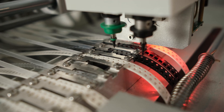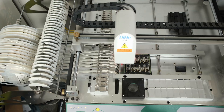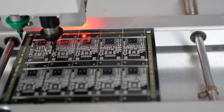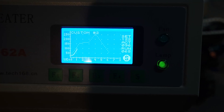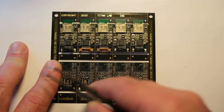I decided to use the pick and place this time because it just takes a lot of time to do it by hand. And if I want to make some changes, it's nice to have everything set up and just throw on the reels. It's about halfway full now, and it just sucks to swap out reels. I've got a bunch of 402 reels not installed, but the 402s had me dial in the system really well. Once I got everything set up for the boards, it dropped everything really accurately in place — probably the smoothest time running that machine I've ever had.